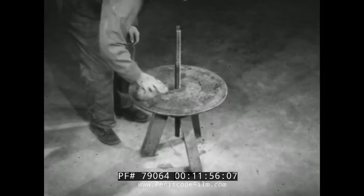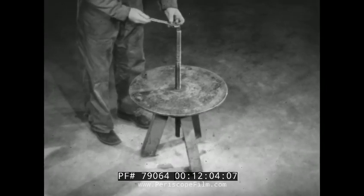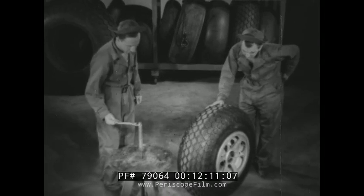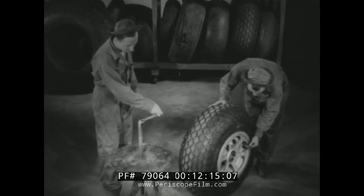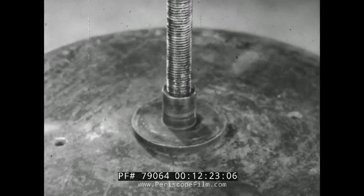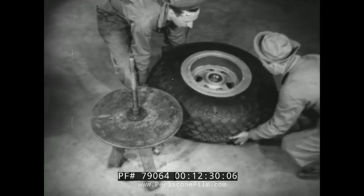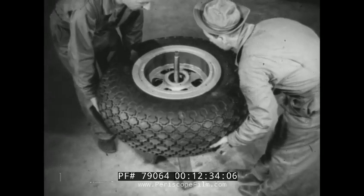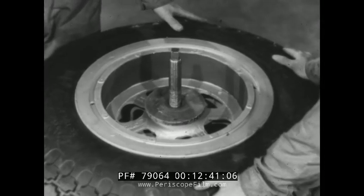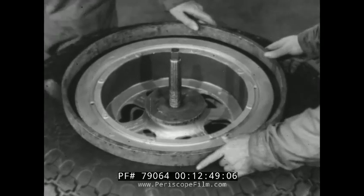While the permanently installed mounting jig cannot be used to loosen the beads on tires with a demountable flange, it can be used to dismount and mount tires on other wheel types. The jig may be used with tires such as this 36-inch tire mounted on a drop center wheel. The valve stem, lock nut, and valve core are removed and laid aside. The proper size bearing adapter is placed over the jig spindle. The tire assembly is lifted up and lowered over the jig spindle. A top bearing adapter is placed over the jig spindle and fitted into the wheel hub to hold the wheel rigid, and a pressure ring of the proper size is put in place.